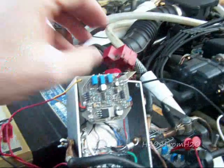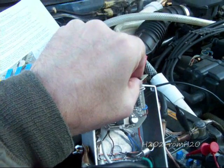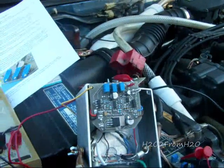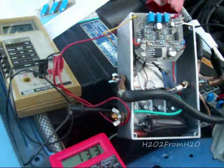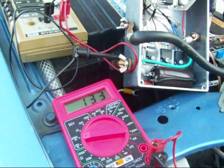Then, once you get it there, you remove the shunt — the jumper — and the PWM current limiting will kick back in. You hear how the engine dropped? That's removing the load from the system, and then we're back down to 13.4 amps.